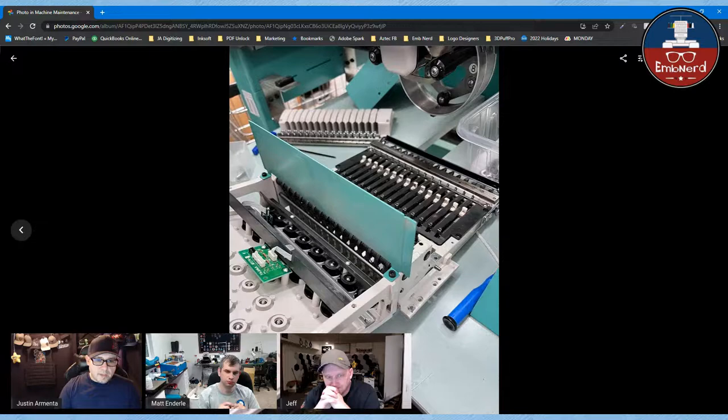This particular issue that we are having, because it was happening on the same needle, we narrowed down that it was the same needle, the same head. So now we know we're isolating it: the problem's on head number 1, the problem's on needle number 10. So of course, checking all the obvious things, the thread pathing was all fine. We were checking tensions, and the tension was off, and we noticed that the actual wheel that spins with the tension of your thread, that activates that thread sensor, wasn't turning at all.